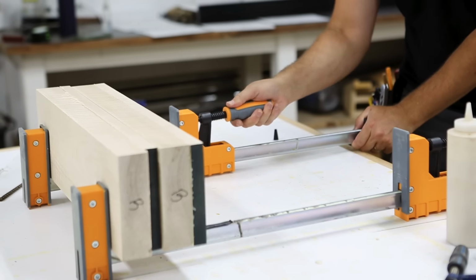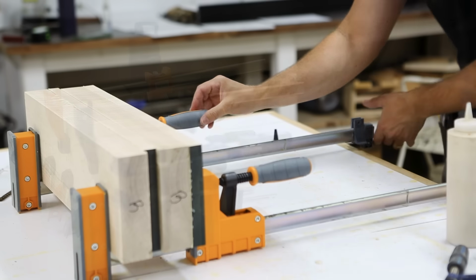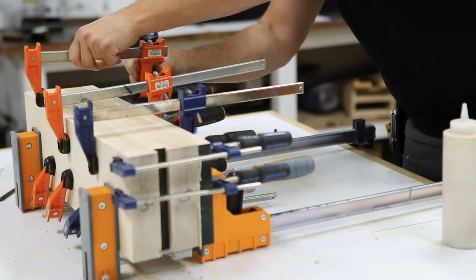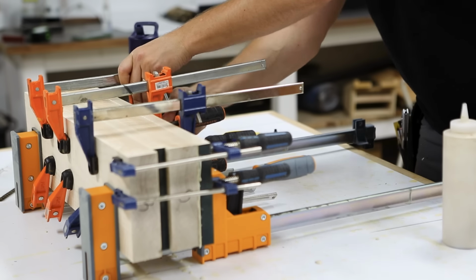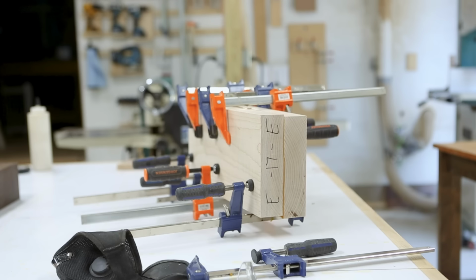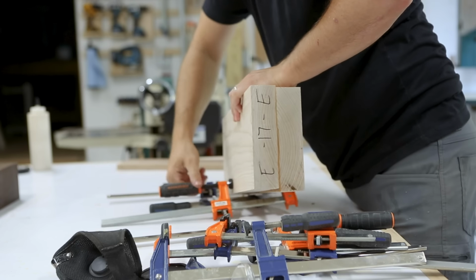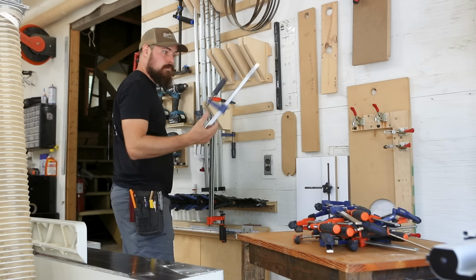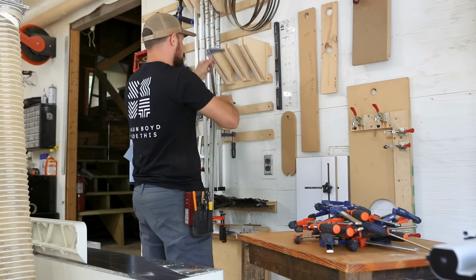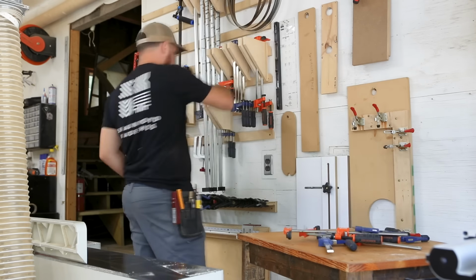I knew immediately why it happened, and even found evidence for my theory. He must have attached the countertops to his cabinets by just screwing them in from the underside wherever, and in particular, across the grain. He just used screws and didn't do anything to allow for wood movement. And the relative humidity change from outside in his shop to indoors in the air conditioning caused the boards to contract and eventually to crack, pulling themselves apart because they were screwed tightly into place without allowing room for this expansion and contraction. These screw holes prove it.